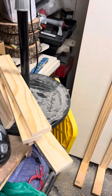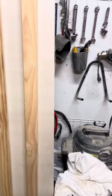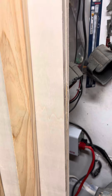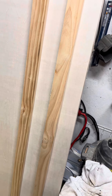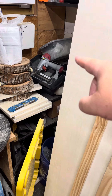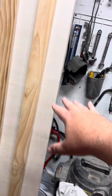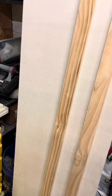This will also get ripped in half to quarter-inch. I have a couple more pieces there in case I need more. Tomorrow I'm gonna do the first door — rip them in half. I think I have enough spring clamps to do it. I'll do one side first, then use just glue and clamps to hold it in place, and then I'll do the opposite side. I'll sand it first, then glue it and put it together — assemble it — and you guys can get a video for that.